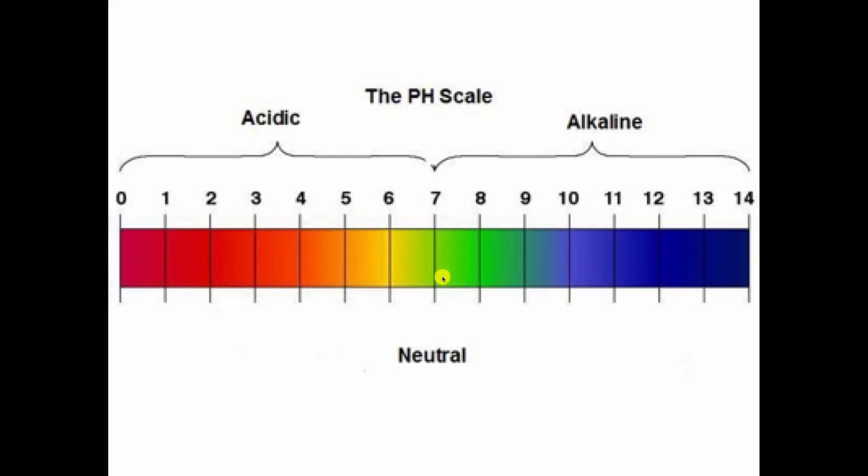We try to keep the pH between 7 and 9. Back in the day, old timers used two things: vinegar and baking soda. Some people think they used these to clean the system, but that's not right — try washing your hands with vinegar or baking soda and see how clean they get. These chemicals are used to adjust pH. If the pH moves toward the corrosive side — which it normally does as carbon dioxide builds up from carbonates breaking down — you balance it back toward neutral using baking soda, which is a base.